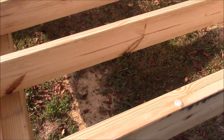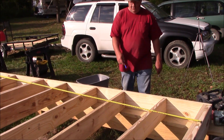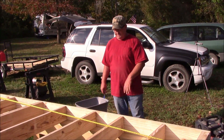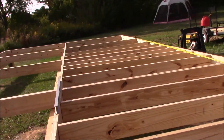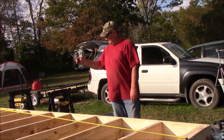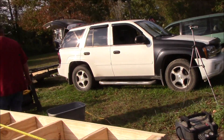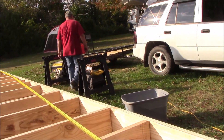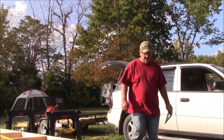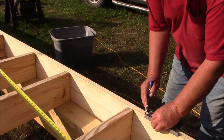I'm going to have it 16 inches on center on this end to match the other end, so you can lay these boards down evenly. When I do the walls, my bottom plate is going to be 16 inches on center, all my studs 16 inches on center as well. What I'll do is lay my bottom plate and top plate, mark them together, and then build the wall. A good tip is to keep a speed square in the work bag and just drag it along your lines.